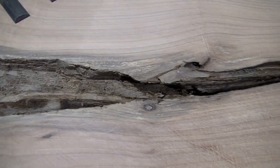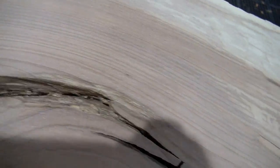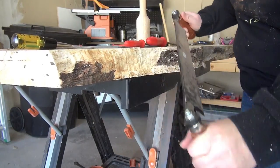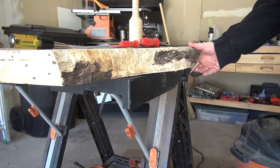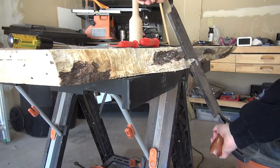So they picked this piece that had the crack in the middle. I used some files and some chisels to get out the softest wood — there was some dry rot in it, so I did have to remove more than I expected. But it came out well. And then to get the bark off the edge, I want to leave as much of the live edge as possible, so I'm using a draw knife just to get the bark off.